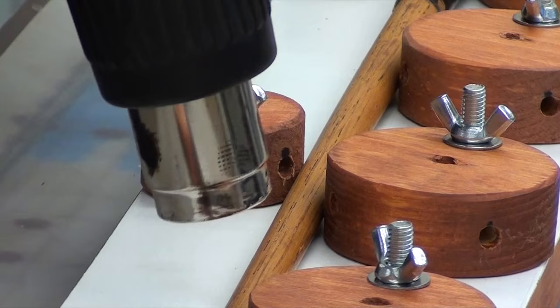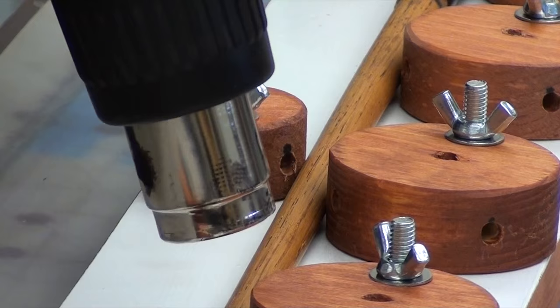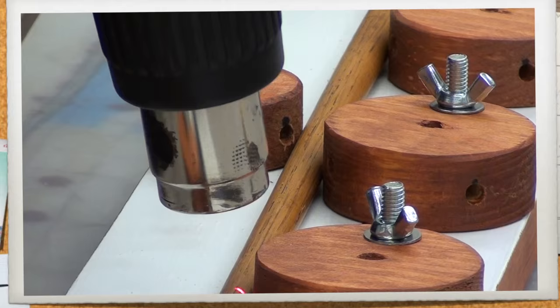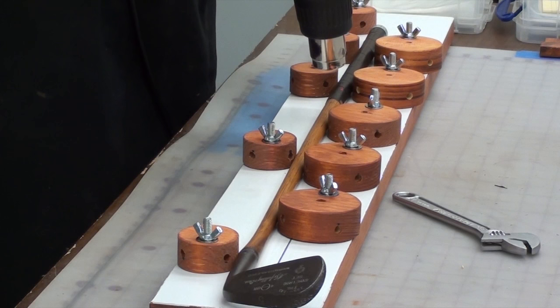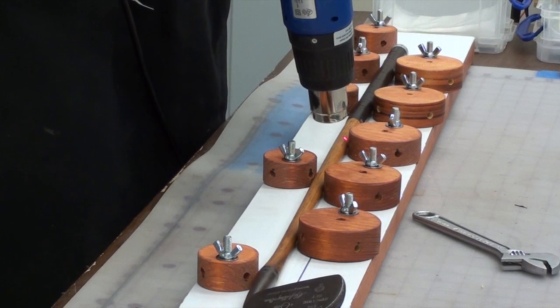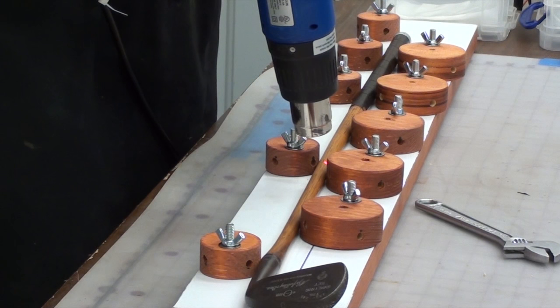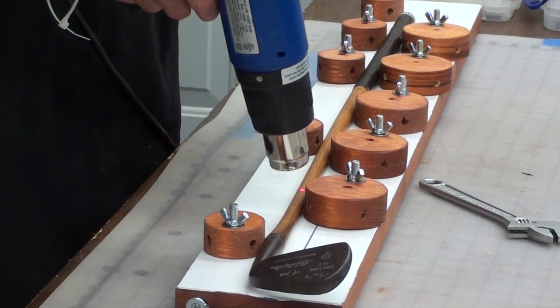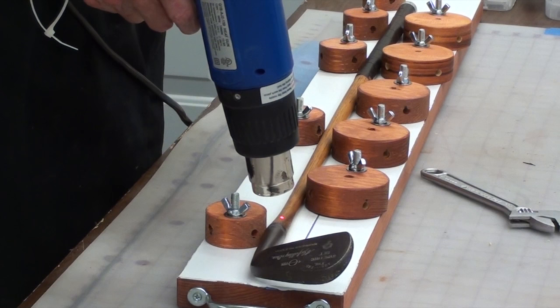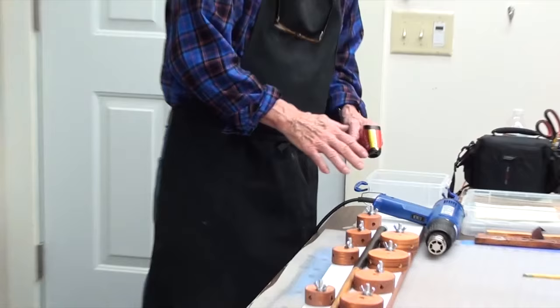Now I'm going to do the next six inches, and keep doing this as I go along and come back at the end. Now we start at the top and go down. We're running about 290, 280, 300 degrees — 288, 296, 293, 295, 280. If it gets a little low you just slow down a little bit, but don't stop. Don't stay in one spot — if you stay in one spot over 5 or 10 seconds you'll burn it. That's running around 290, 280, 270. So that basically is all that has to be done as far as heating.